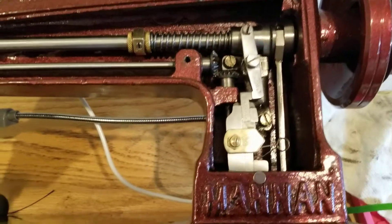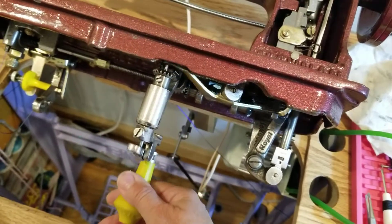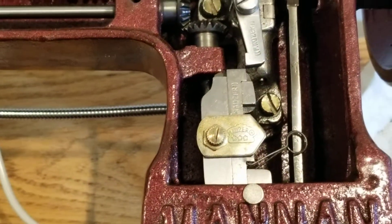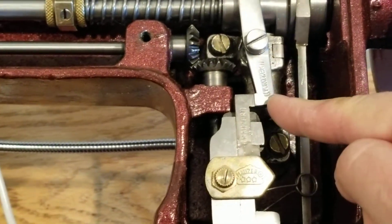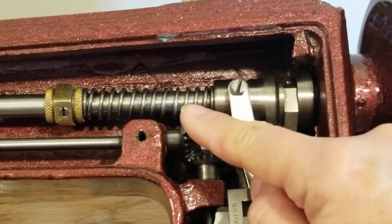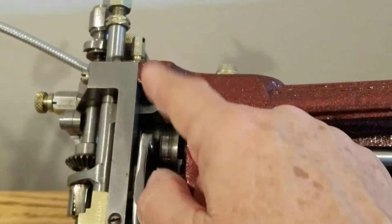So this piece here, it goes up and down when you pull on the handle below the machine. That is what is engaging and disengaging the stop-motion. You can see when you pull it up and down. When it's up, the stop-motion will engage and this piece here gets blocked, and this metal thing behind this screw moves to the left and opens up and takes this top shaft right here, which engages and disengages the needle.